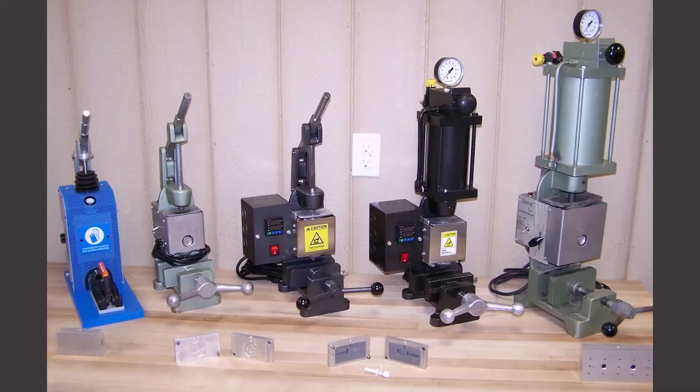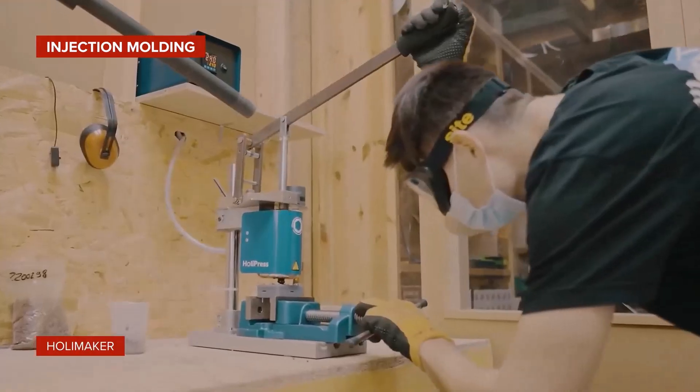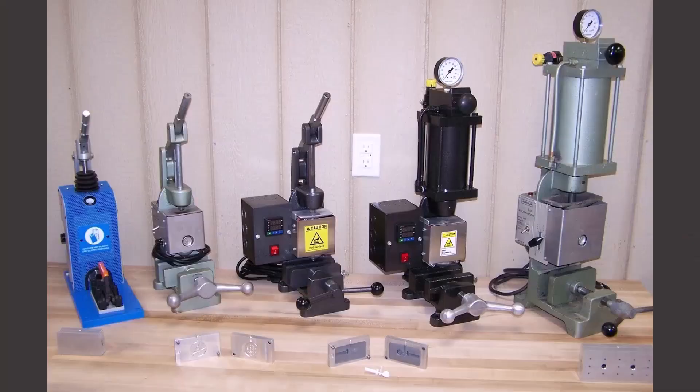With Brasscom's case, we looked at a medium-sized injection mold machine. But there are smaller, more cost-effective benchtop variations you can use. The three on the left are manual injection mold machines using a lever process, and the two on the right are pneumatic. Keep in mind these are really compact and don't allow large molds to be fitted in them.